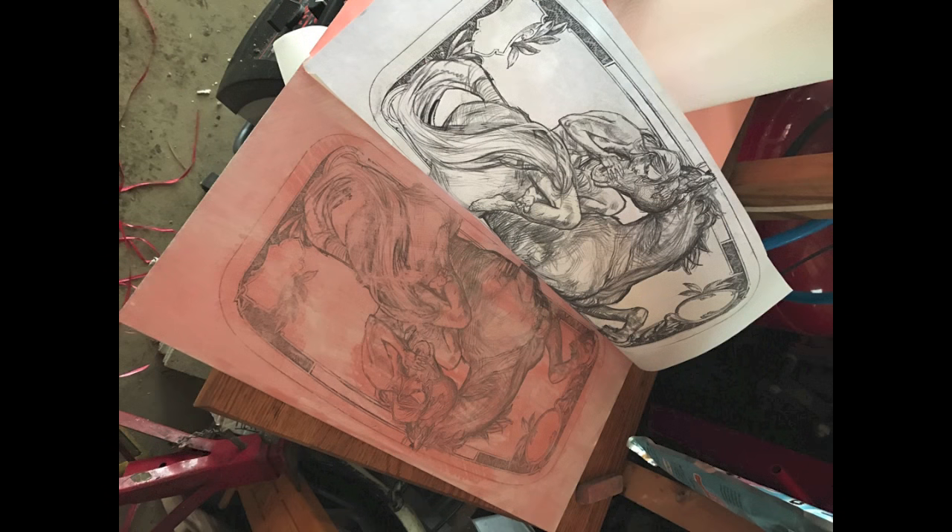Alright, enough chatter — let's get this thing on copper. The first step was to take my copper and lightly clean it to get the oil off, then I coated it with white FW ink. Then I did what's called an old school laser transfer: I got a Xerox of my image in reverse, laid it face down on the FW ink-coated copper, used lacquer thinner with a paper towel, rubbed the back of it, and used a spoon to rub the laser toner off the paper and down onto the copper. Do this in a well-ventilated area — I'm wearing a mask and working out in my garage.